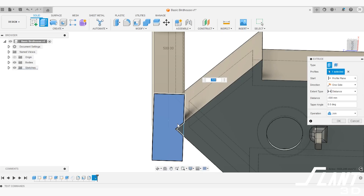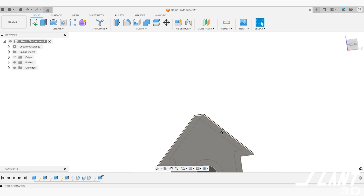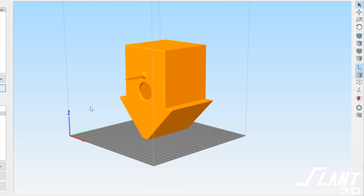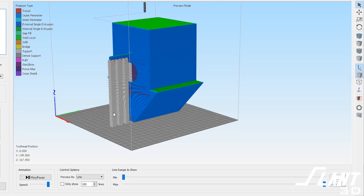The first thing you'd want to do is flip it upside down. Now it has a pointed roof, so what you'd do is crop the top of that roof just a little bit so it has about a quarter-inch-wide strip that can be printed on. Now the entire house can be printed upside down with virtually no support at all. It's a very minor modification that doesn't majorly change the aesthetic of the birdhouse.